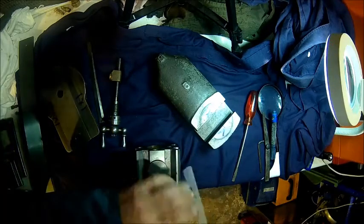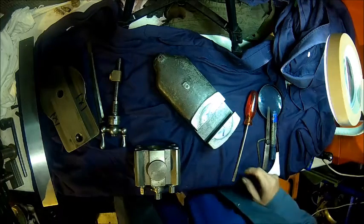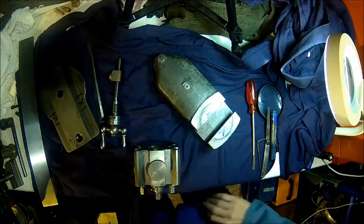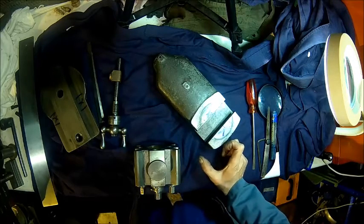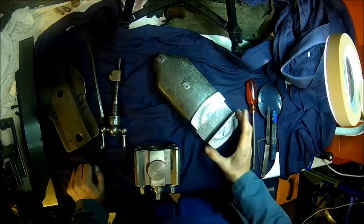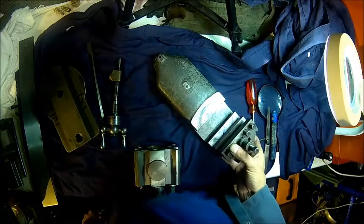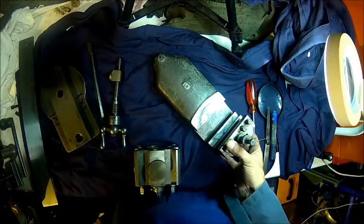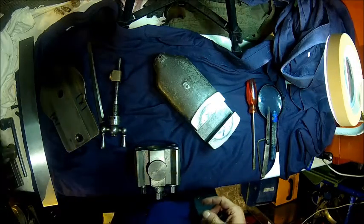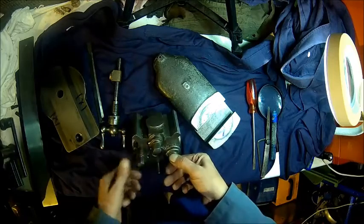Well, that's 100 millimeters, so it's most likely an E type multi-fix, which are hard to get because they were introduced later. B is a bit longer, it's about 120 or something like that. So it's a bit too big for that machine, or for the cross slide. If you use any sort of tool holder, it shouldn't be much longer than your cross slide width. Otherwise you're sacrificing some travel, things like that. So this is the right size for that machine. It's just I'm not used to it. I think it's not a bad tool holder, I'm just not used to it.